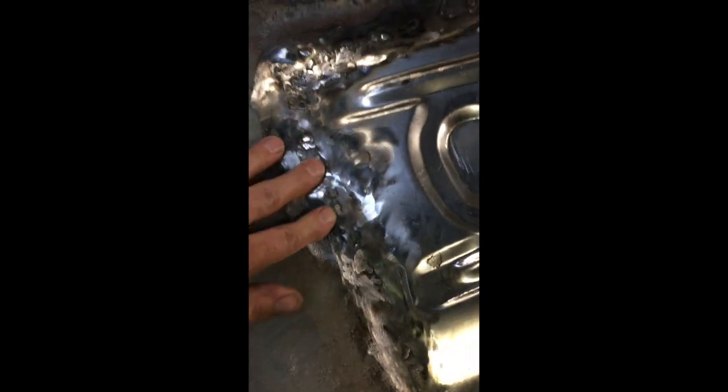This corner I had to redo just today. It looks globby but I'm going to smooth that out anyway. The good thing is it's solid — no holes, just solid metal. Then I got up to the previous owner's patches that he had just lightly tacked in. By that point I had my heat and wire speed dialed in and I did so much better — it was kind of amazing.